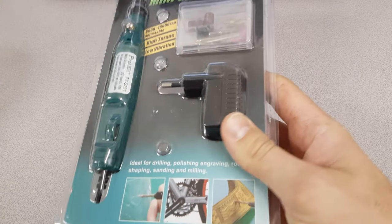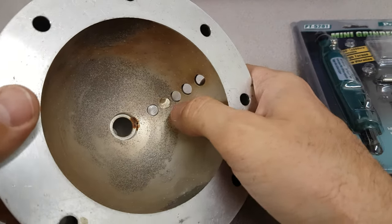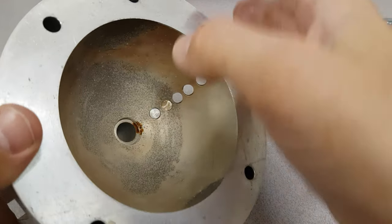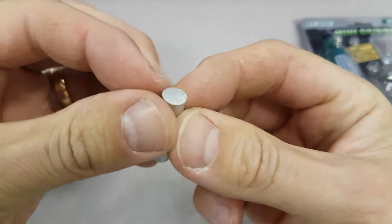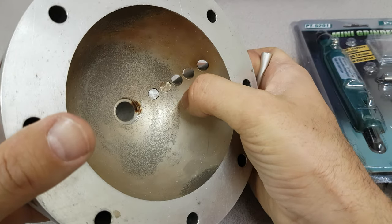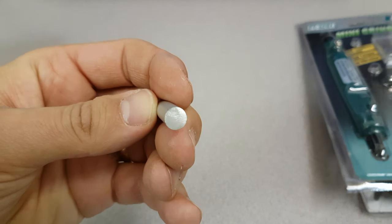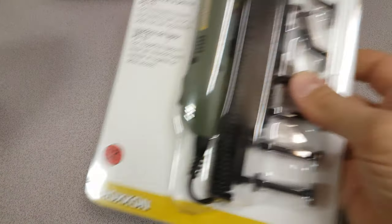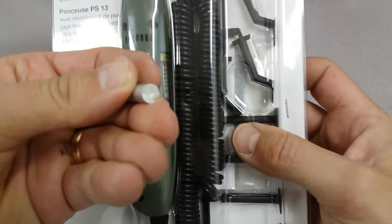I also got a kind of mini grinder here — ideal for drilling, polishing, engraving and routing, so it's got a couple of bits in there. The idea of getting this was firstly to ream out a little bit from the inside of this, because what I had to do to get these two pieces in here was actually abrade a little bit off of the diameter with sandpaper. My view is to actually ream that out so I can just use the stock billet diameter, then with a straight hacksaw, rough sanding, and then use this linear micro sander to polish the ends up for the experiment.